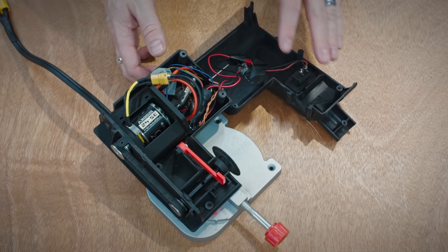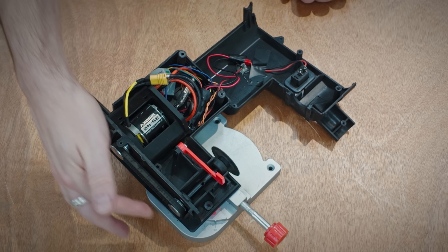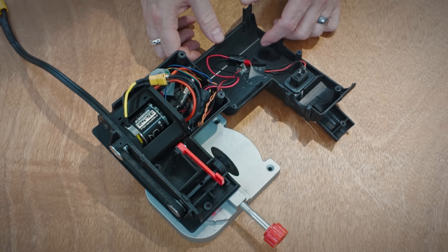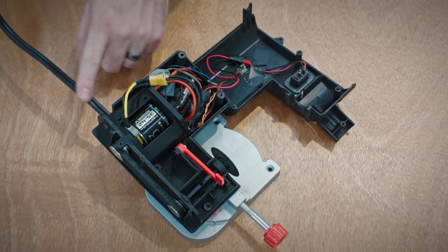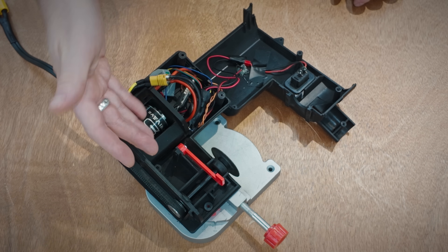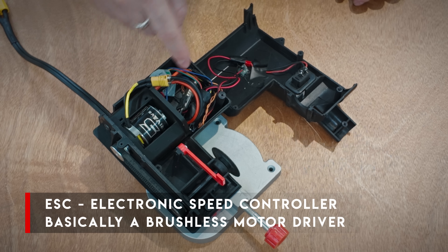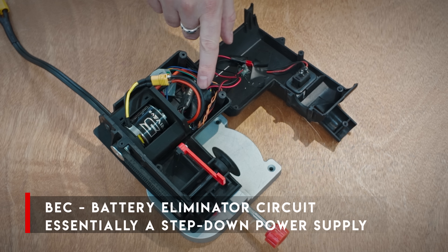Here's what the guts of the Monster look like. For the motor, I'm using a brushless DC motor with a one-to-one gear drive — this is actually the same pulley system that was in here, I just had to find a different pulley that fit this motor. The motor is a prop drive 3542 with a 1250 kV rating. The kV rating tells you how fast that motor will spin given the voltage input. Since I'm using a 20-volt input from a tool battery, 20 volts times 1250 equals 25,000 — so this will spin at 25,000 RPM on a one-to-one ratio. For the electronics, I'm using a 60-amp ESC, custom tuned — one of my old weapon motor ESCs from a Beetle weight — controlled by an Arduino, and there's also a BEC which provides the voltage for the Arduino.